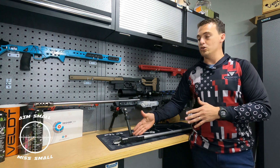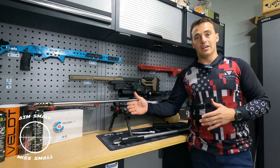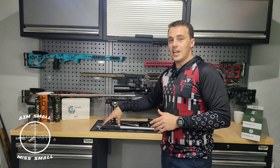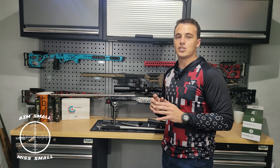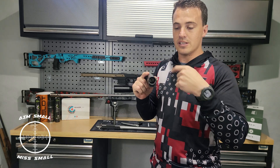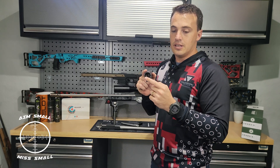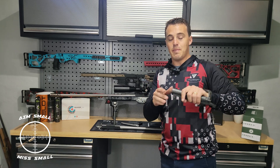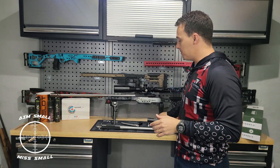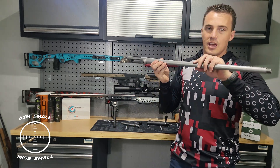Just to give you a rundown — I used my 223, which I took to Eagle Barrels and they did the blueprinting for me. A little bit more on the tolerances: the action had a 0.4 to 0.5 millimeter spread just on the front face. You'll see how I took a video of when they pushed the meter onto the front face and spun the action — the difference in the surface was 0.4 to 0.5 millimeters. That means if you put the barrel on there will be a gap of 0.4 to 0.5 millimeters.